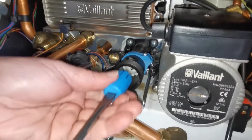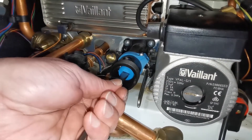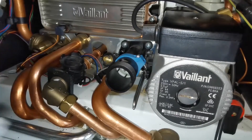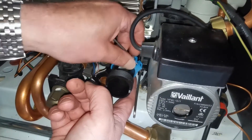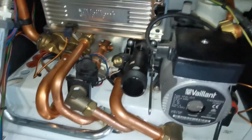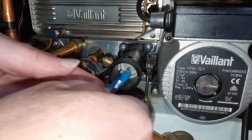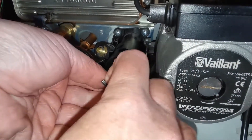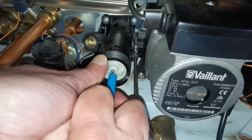Now insert your locator and, using a screwdriver, turn it counterclockwise to unlock the cartridge. Remove the clamp. Use the extractor to mate it to the pin and, with an allen key as a handle, pull out the unlocked cartridge.